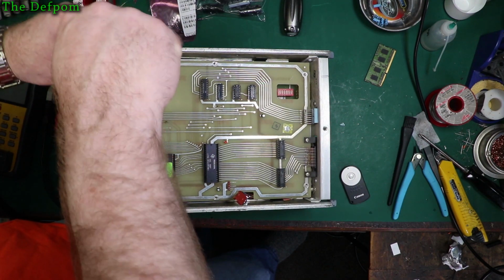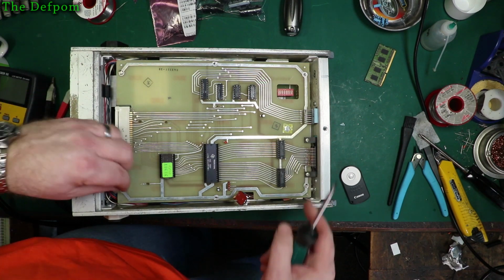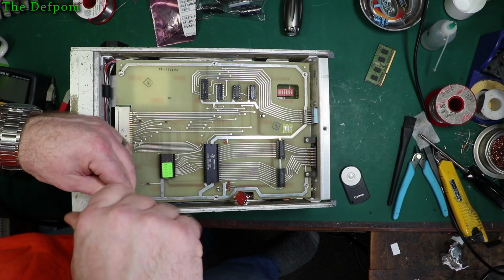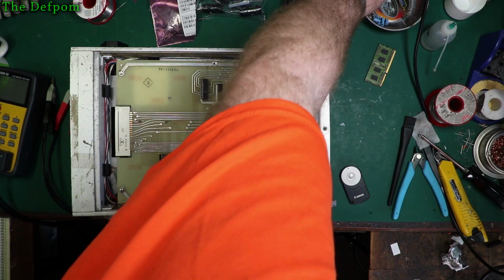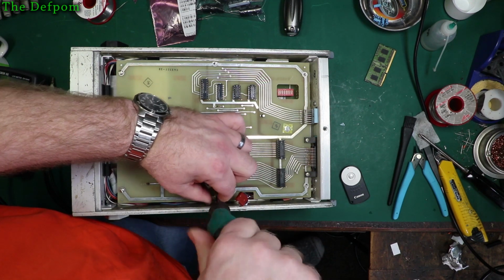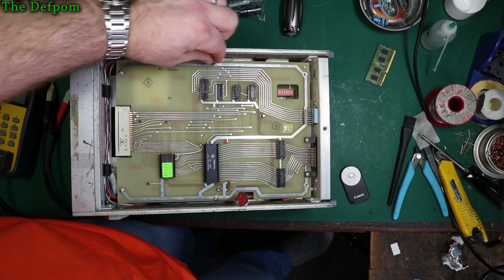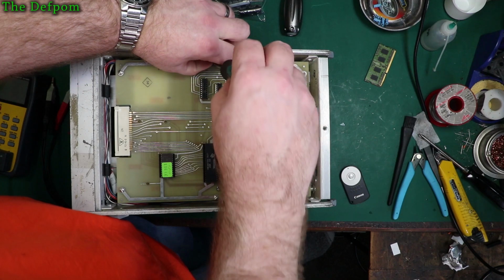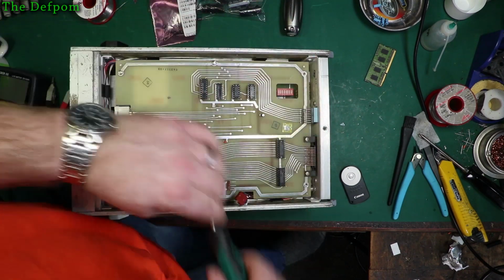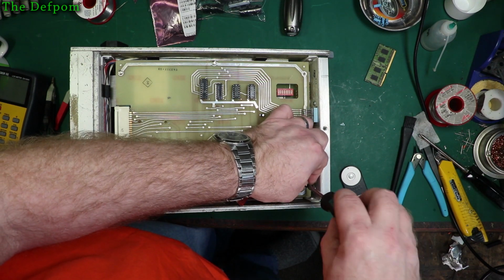It says meters can be used quite well for all sorts of functions. Anything you need to measure losses or levels. So you're limited by imagination really. You can use them for measuring cable losses and stuff like that. But you have to bear in mind, if you're measuring losses, that you're measuring at the frequency that the instrument tests at, which is generally 50 megahertz. So it will tell you at 50 megahertz, not at 200 megahertz or whatever you may be trying to figure out the loss for. So you have to extrapolate what your actual loss will be at a different frequency. Generally the best thing to do is just look at the specs for the cable and find out what that states anyway, if you know what the cable is. Of course, sometimes you don't know. But it'll give you a ballpark loss figure.